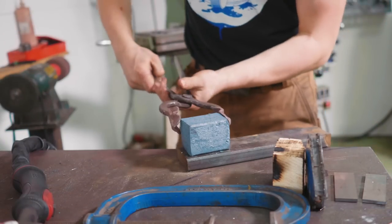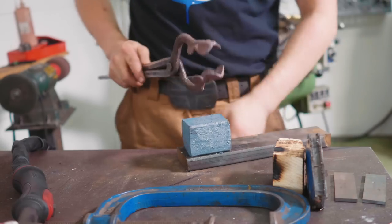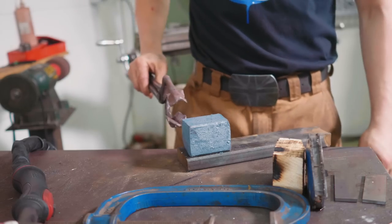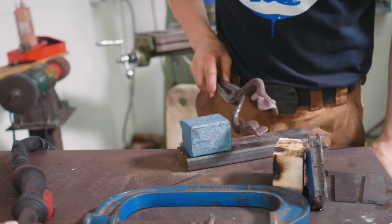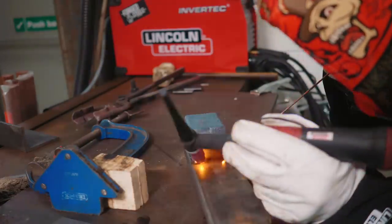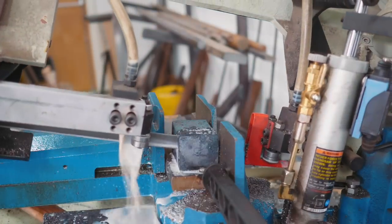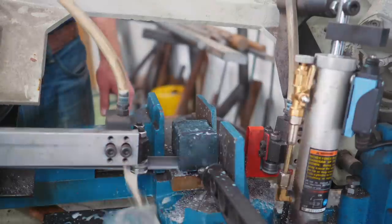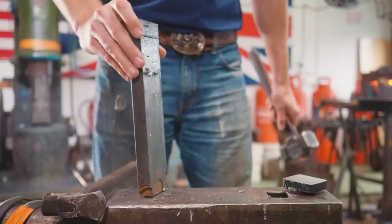The hammers. This, of course, is that fabulous piece of Damascus steel that we're working on. But the interesting thing about this is indeed the fact that there's no way we're going to be able to fit that in the saw. So what we're going to do is a couple of tack welds to this piece so then we can grip this main flat bar in the band saw, and then we'll cut off our slice for the belt buckle and forge the rest into a puck.